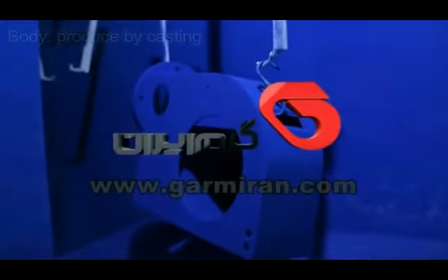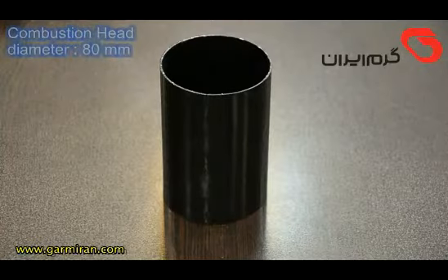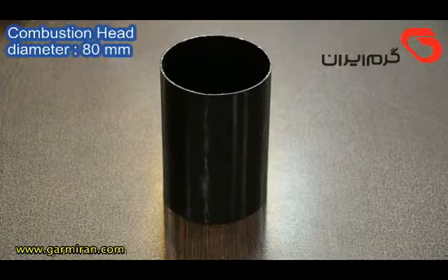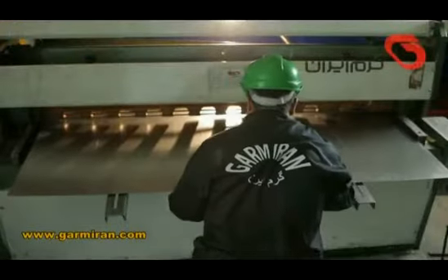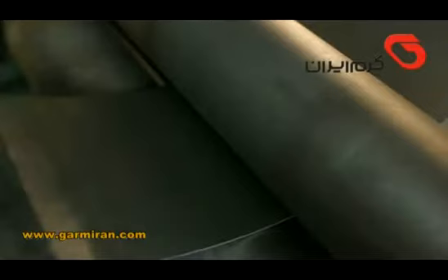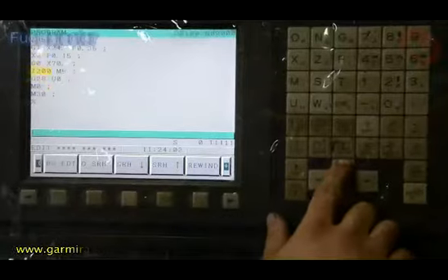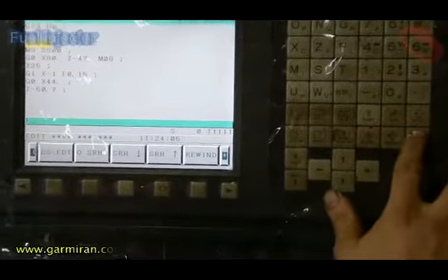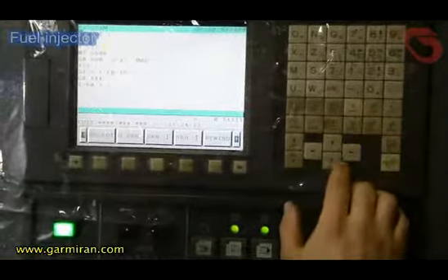Other parts are shown on the bottom of this image. The combustion head is produced by rolling method. The diffuser needs to be turned using a CNC machine; after that, flame spray is applied, then drilling and pressing are performed because of the profile created.